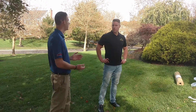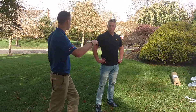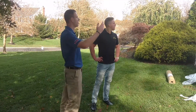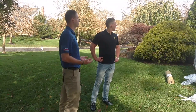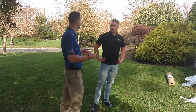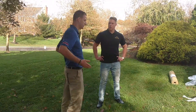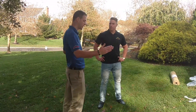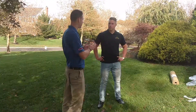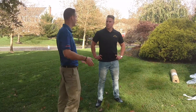So what we're going to do is cover over where the old vents were. We're going to put down new CDX plywood and cut in ridge vents along the ridges of the entire house. It's going to be a more seamless look and the shingles are going to look better. It'll also perform better because now the exhaust runs along the entire ridge, and the air will go between each bay where the rafter is, so every part of the roof will be ventilated.